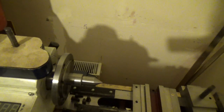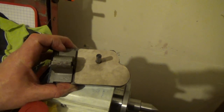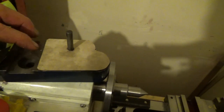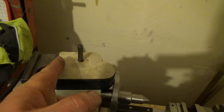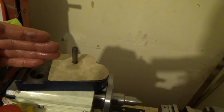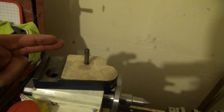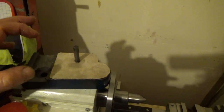I'm going to put the half nuts in for demonstration purposes — they will fall out. There were chips on top of the half nut and in the gibs as well. I'm thinking about extending the template outward and quite wide, slitting it roughly halfway down and folding pieces of steel up and back on itself a little bit. That should deflect chips out of the gibs for the half nuts as well.